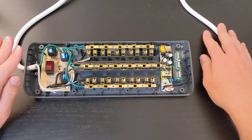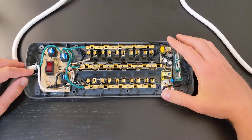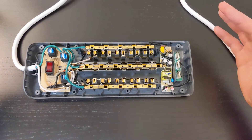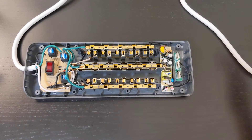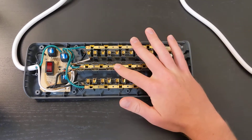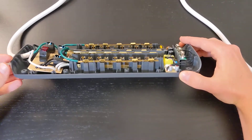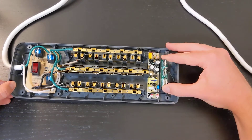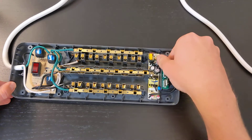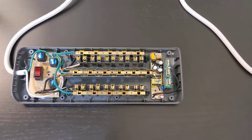I love how all the conductors have the correct color of insulation — that's a nice attention to detail. They could have made these all the same, but they didn't. There's a lot of extra dead space which would have been nice to consolidate, but it's good to err on the side of safety. All of the conductors are separated from each other by nice tall plastic walls. The bus bars are tucked in there, and the USB side is obviously low voltage. You're going to plug it into your metal-bodied cell phone and hold the phone to your face, so you want the USB chargers to be really well isolated from the mains voltage.